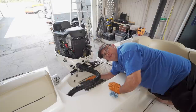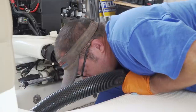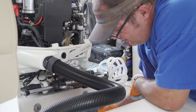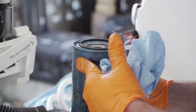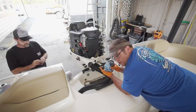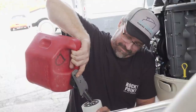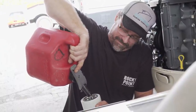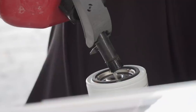Now we're going to replace our fuel filter inside the boat - the fuel filter slash water separator. Sometimes these filters tend to stick because technicians don't put grease on the O-ring. Use your oil filter wrench, or a large set of channel locks. If things get very extreme, you can poke a hole with a screwdriver and try to crank it off that way. Another useful tip: if you're on a boat, use your fuel cutoff valves and shut them off before you pull this filter off because they always leak fuel. Dave is going to fill the filter up for us - we always like to prime them first so our client doesn't have to worry about it. I've had clients leave the dock, not prime them, and run out of fuel. So we fill all filters.